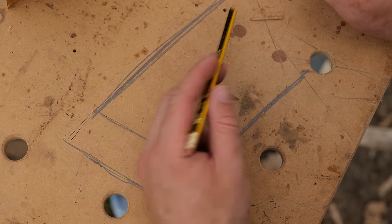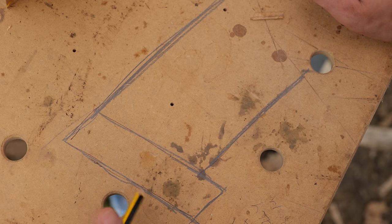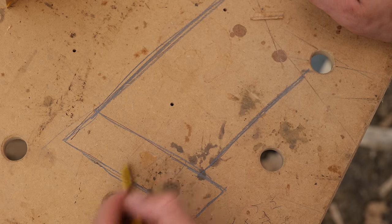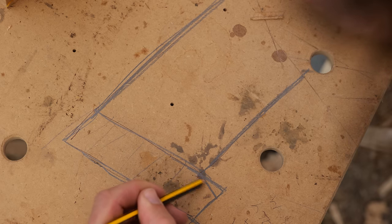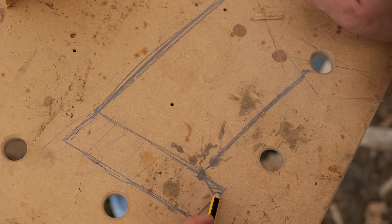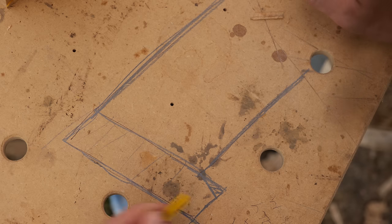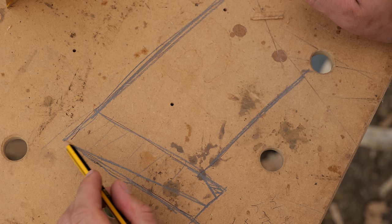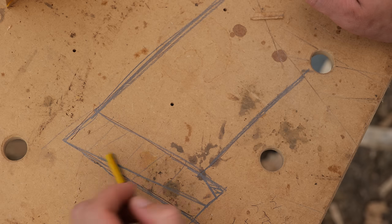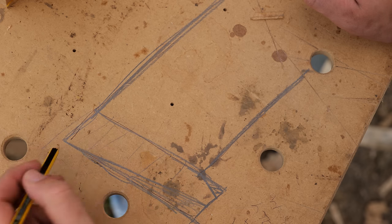And what I'm thinking is, if we've got the front currently looking like this, so square bottom, square top, and then angled from the front, obviously dovetails are going into the end component like that. What we're going to do is create a little angle here to start with, so all of this will be waste material. And then we're going to draw a line from that top corner down to somewhere here. So effectively, it looks like it's tapered, well, it is tapered dovetails, I suppose, from the top down to the bottom. So you're left with this really cool, angled looking thing.